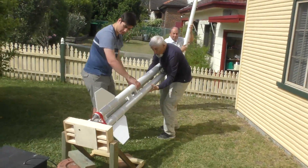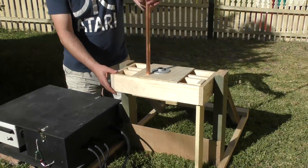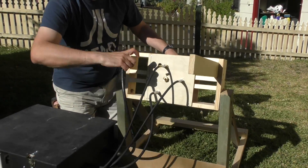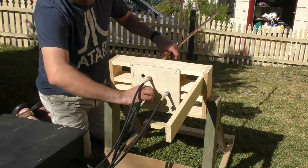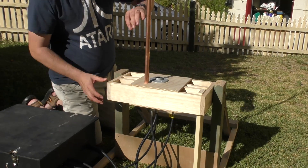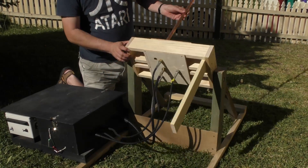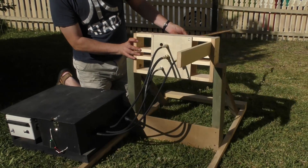We practiced a couple of times getting the rocket on and off the launcher. We may need to add some extra supports for the booster when the rocket's on its side. The next day we added a set of hose connectors to the bottom of the tilting platform so that we could check how far the hoses would reach. We may need to elevate the air control box slightly but this setup should work fine. I also added an extra leg to the tilting platform to keep it upright, though the final design will be a little different and we'll cover that in a separate video. We still need to work out a few small details but overall we're quite happy with the layout of the launcher and we can now start fabrication.